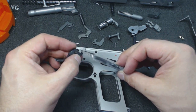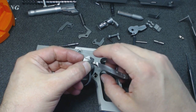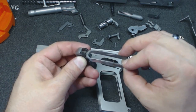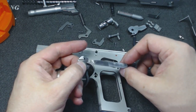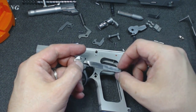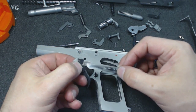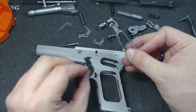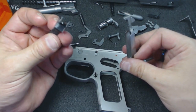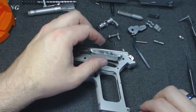Now, what this means, though, is that since you've got these sharp points of contact in that V-shaped groove on the trigger bar, it means the trigger bar can be going up and down willy-nilly and not really have any impact on what's happening with the trigger. So as you're pulling, the trigger bar can get disconnected, reconnected, push into other stuff. It doesn't really matter. There's no angles there, you've got a perfect pivot point, essentially. So from a machinist standpoint, I'm sure somebody in the machine shop wants the designer dead, but from a functional standpoint, not so shabby. Now here's where things get weird.